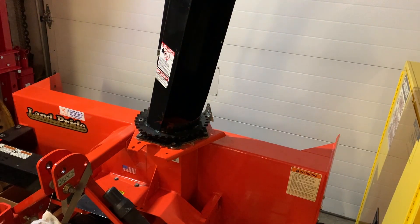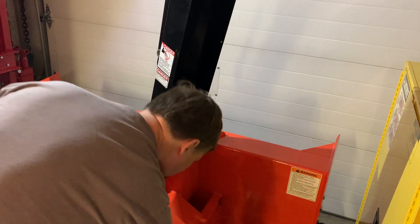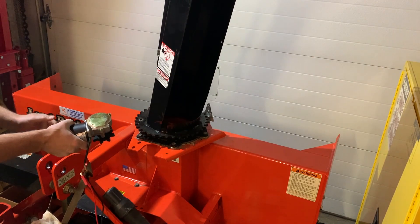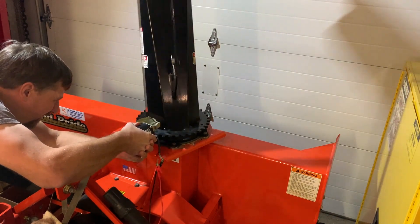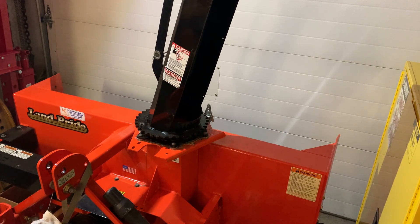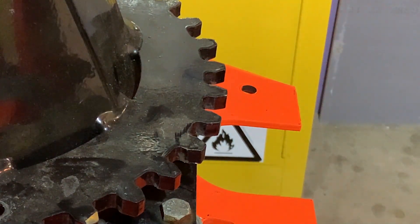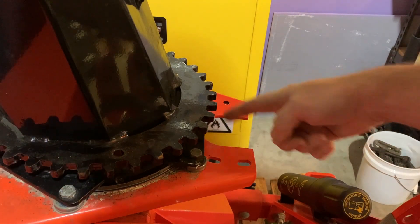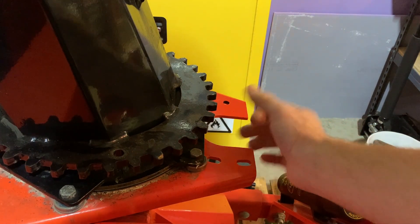Let's try it again. I'm still at 13.8 volts, so this is our rotation speed while the tractor is actually running. That's a great speed, and that's with eight teeth on this gear. I'd love to say I performed a bunch of advanced math but I kind of just guessed — eight teeth at the same pitch as the large gear for the diameter I wanted for the drive. I'm going to call that a success. I think it's time to actually go ahead and design the piece that is going to hold that gear motor in place so the pinion can turn this big one.